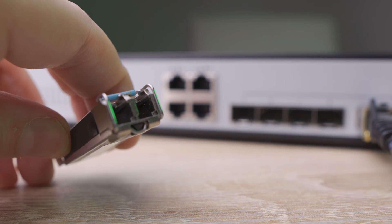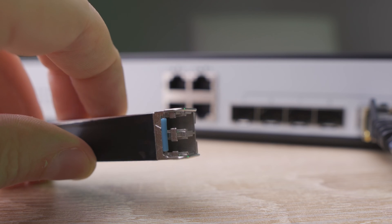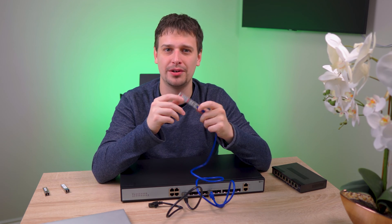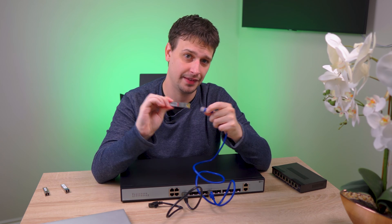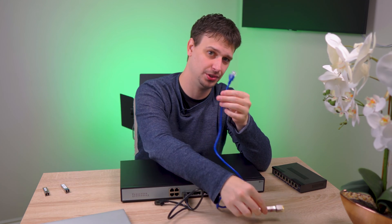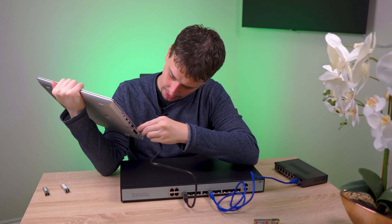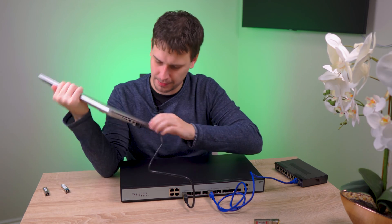If you are using fibre optic both ends have to be connected to a transceiver. However ethernet has an extra trick up its sleeve. Because ethernet is layer one and layer two of the OSI model, the other end of the ethernet cable does not have to plug into a transceiver. You can use the RJ45 connection that's already on there and plug that into any other device that has a standard RJ45 port. Easy peasy.